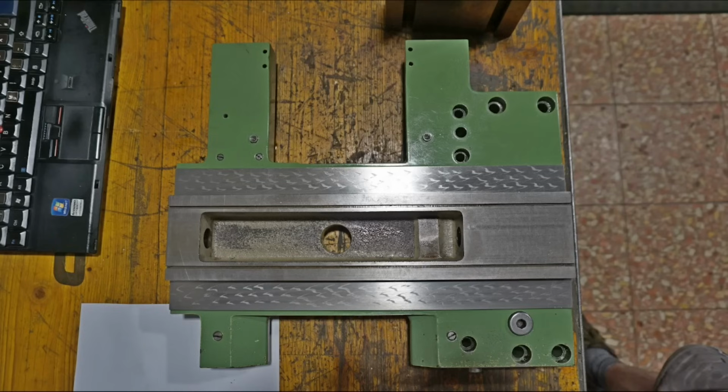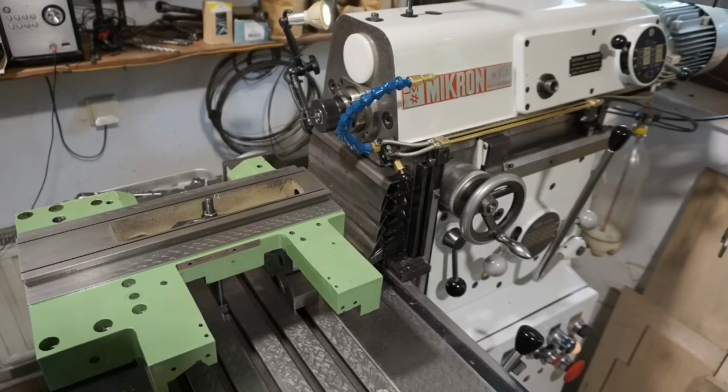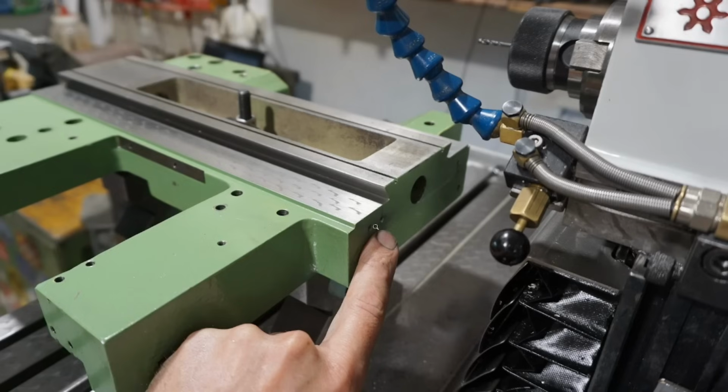So you see, this was a quite critical step in that whole modification process. And in order to minimize the room for positioning error of those holes, or at least to move the room for error to my side, I decided to pre-drill those holes so that the EDM company would have something to center up upon and wouldn't have to use numbers. So I clamped the piece in the mill and used the horizontal spindle to pre-drill those holes. So you see 1, 2, and 3. And here they are already tapped for M4, because later on they will get plugged with an M4 set screw.